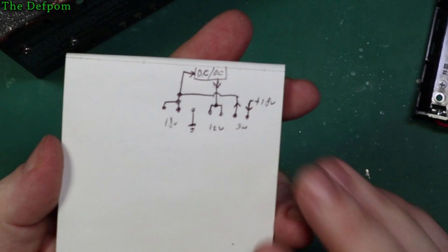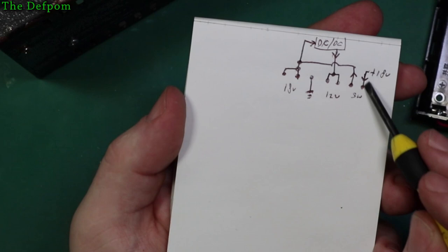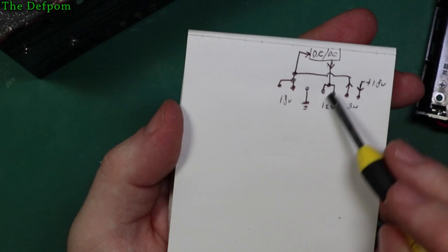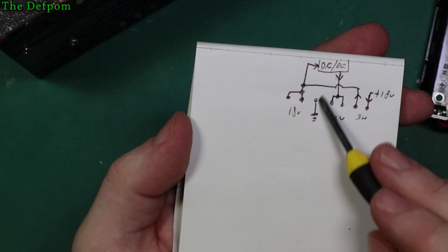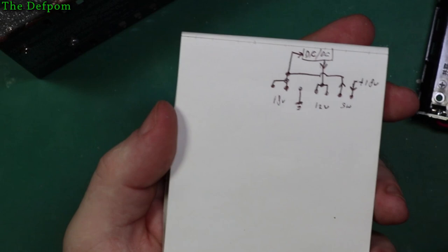So these are the actual terminals on those jumpers on that PCB. Right, in the order: you've got the switch terminals on the end, and then we've got the 12 volt connections which are linked currently, and 18 volt connections which are linked currently. I'm going to leave those linked, and the middle pin there is the ground. So what I'm going to do is run the 18 volt in from the battery pack. So the power supply and the battery pack link together, as I said before, off of that diode. So it goes power supply, diode, battery pack into the switch connection.